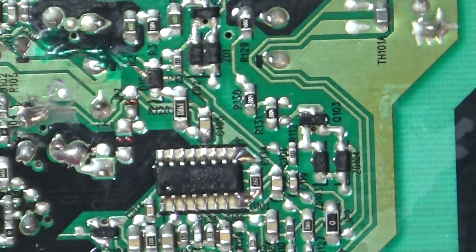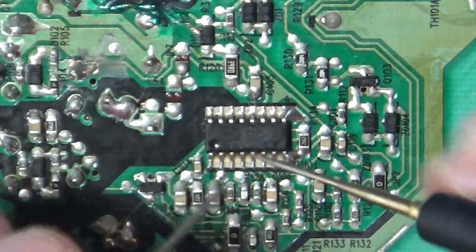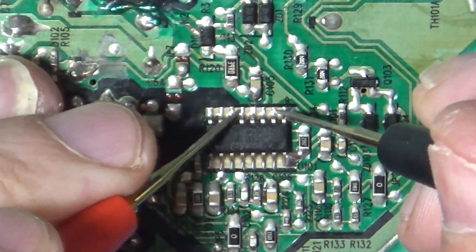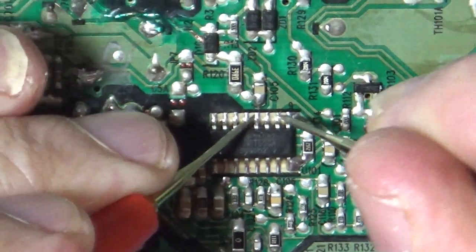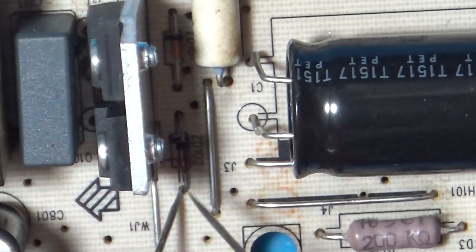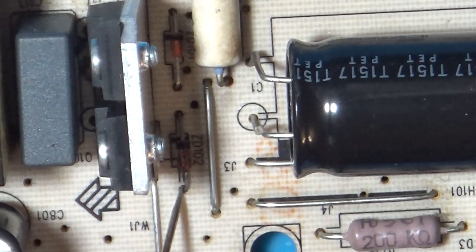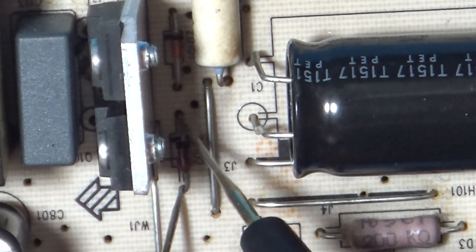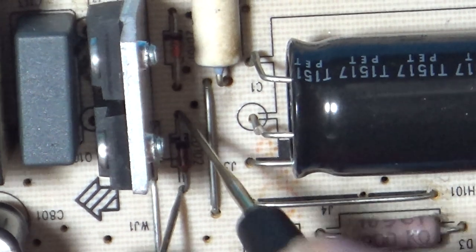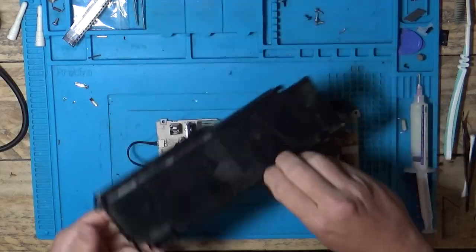Let's warm up the area and then we'll flow down the chip. We've got 10 of these chips so I'm not worried if it destroys it straight away. Let's get some heat on here and try to get this solder to melt. Solder is melting already. I'm just going to press down and hold it. Wait for the solder to solidify. Hopefully that's it. I'll just give the feet a little nudge to make sure they're soldered on. I would say they're all on. Get some flux on there and solder on the tip — just gently touch these up. I think we've got a bridge up there — clean the tip and the bridge is gone. They look really nice now. Quick clean of the flux, use hot air to dry that off.